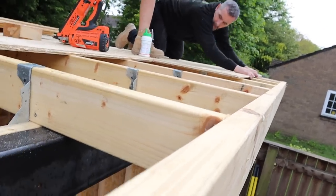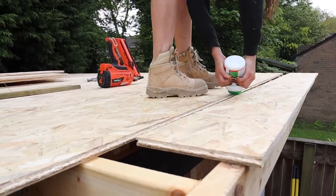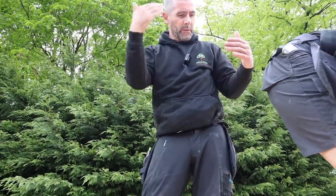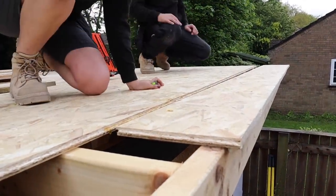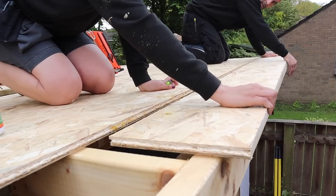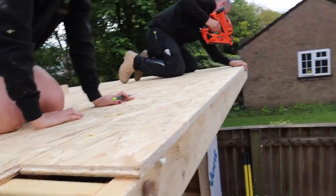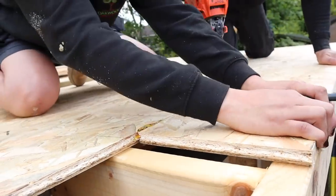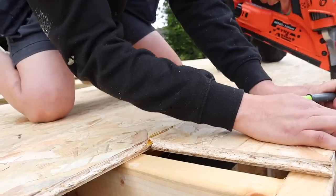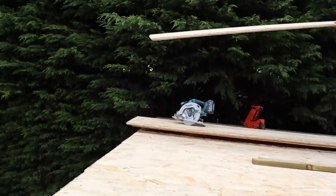Right, that'll be his roof — there's a 75mm pitch on it, three inches up to nothing over three metres, which is enough. We've built his foot wall higher and let it slope up at the back. It's the last piece now, so we'll get rid of this offcut — it's no use to anybody. I'll cut it to length first — 1123.